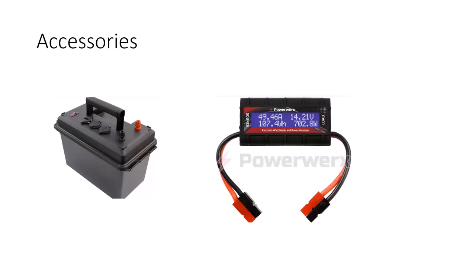Optional accessories include a battery box — I have one and it's pretty convenient. It's nice to have because when you lose power and everyone still wants to charge their cell phones, there are USB outputs on the battery box. To really get an idea of how much power you've pulled out of your battery, you can use one of these meters — I show an example from Powerwerx. The display rotates and gives you various information including how many amp-hours you've pulled out, which tells you how much you have left.